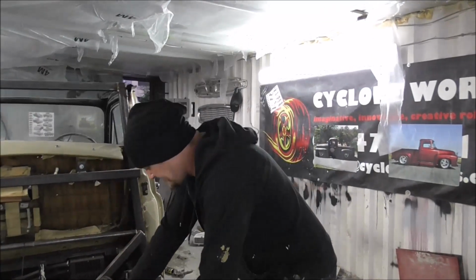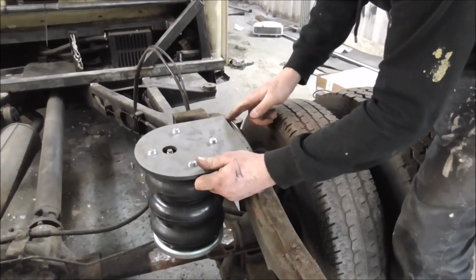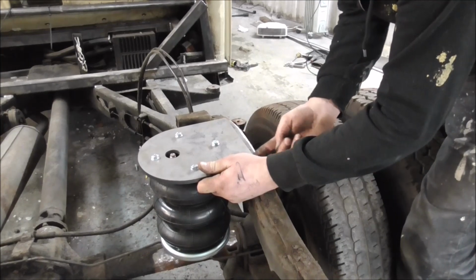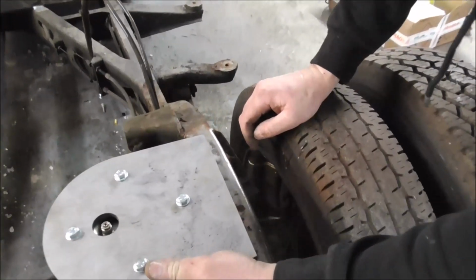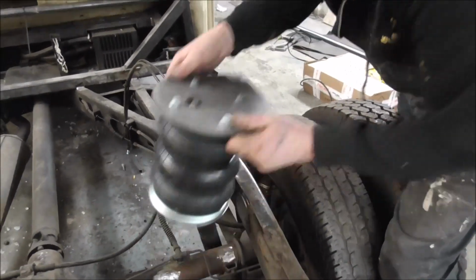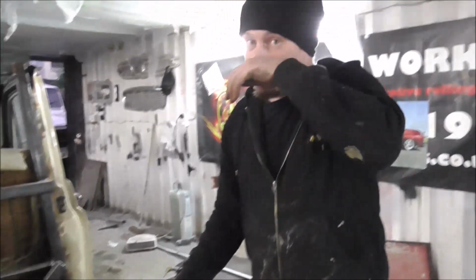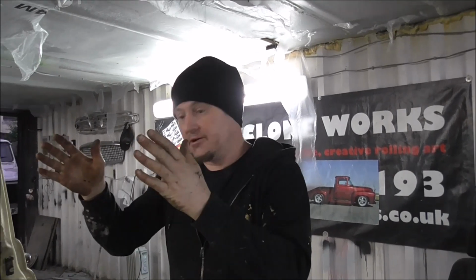We're going to drop this in, it's going to sit there, sits half on and half off the chassis there, so we can get a nice weld down there. We've got that little fillet piece, but for now what we're going to do is tack this on, in this corner with a nice big tack, so that we can then adjust that top plate around to get it dead square, and in the right position before we weld anything more.